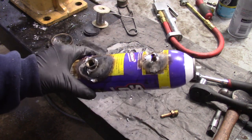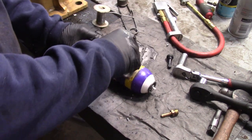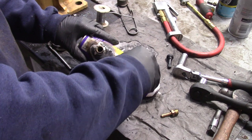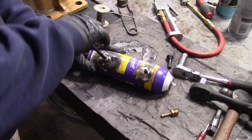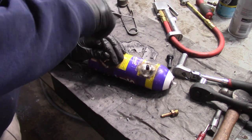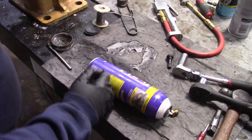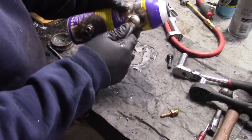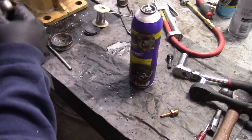You can hear there's a little bit of sediment in there — I'm just going to wash that out until it comes out and shake it. Now put in the Schrader valve. This is a plug. Then we'll fill it with air and we'll see if it leaks — you might need to touch up the solder. This one's good.